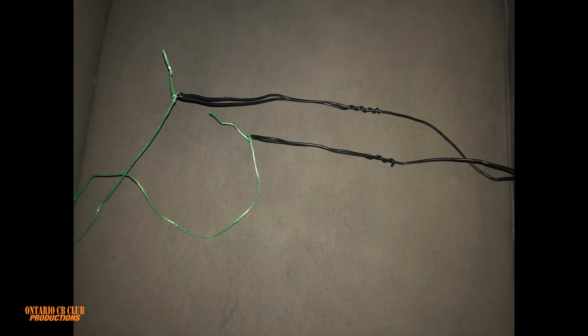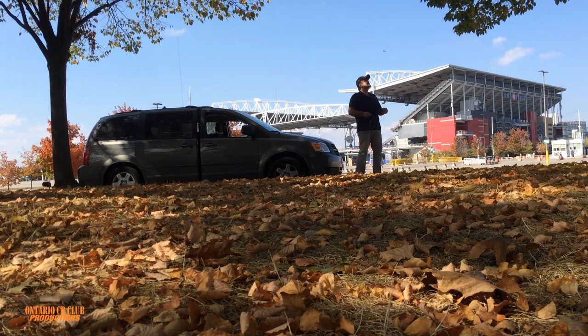The 14-gauge wire on both ends. And on this picture you will see how I fold the ends of the antenna, and then I make a knot at the end. Then on the other end I tie off the twine, which I left about six or seven feet long. The way I'm throwing this is — at the end of the twine I tie off a whole roll of electrical tape, which is heavy enough to go in between branches, and I throw it on the tree like that.